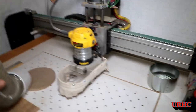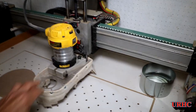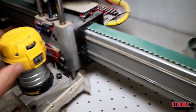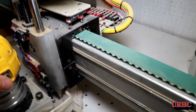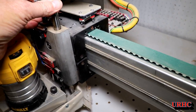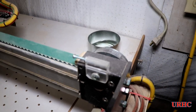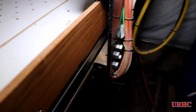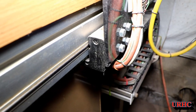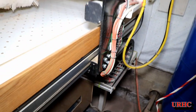This is a router I built years ago out of some really lightweight 8020 extrusion. The bearings were not made for the kind of use I put it through — I got about 500 hours out of it, and the bearings are all starting to go. I wanted to go to a water-cooled spindle to quiet everything down, but the weight of the spindle would have destroyed this setup, so I decided to try some Chinese slides and zero-backlash lead screws that are reasonably priced on Amazon.